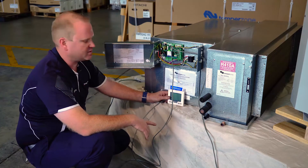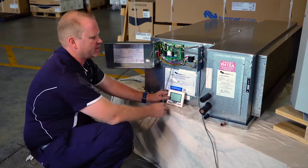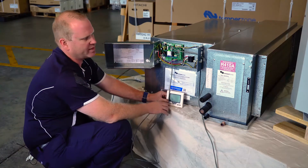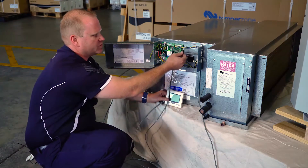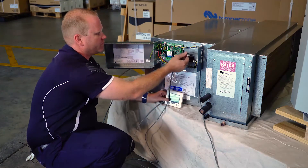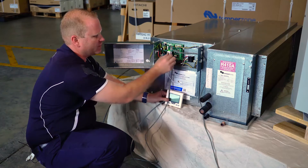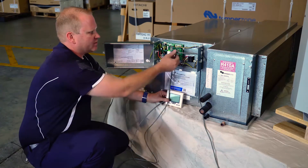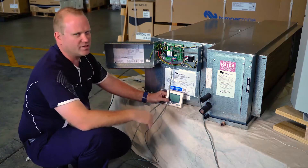Now that we've wired our TZT controller to our IUC, the next step is the interconnecting cable between our ISD unit and our OSA. This cable is a two-core shielded cable, which we've brought in through the electrical panel and is terminated into the same terminals as our Modbus connection for our TZT controller. The two terminals are A and B, and again are polarity correct and require the same connection at either end.